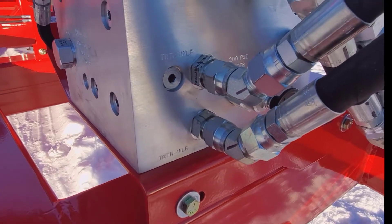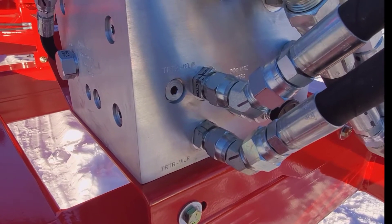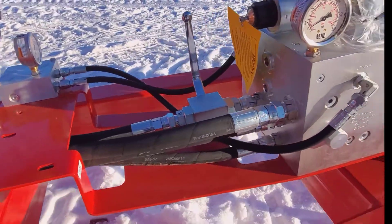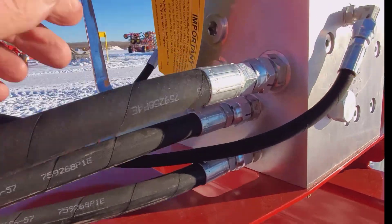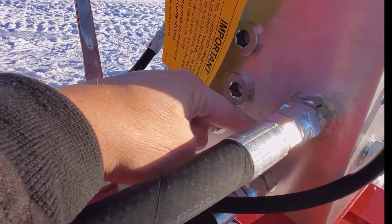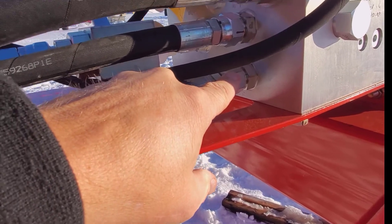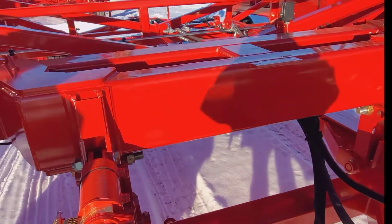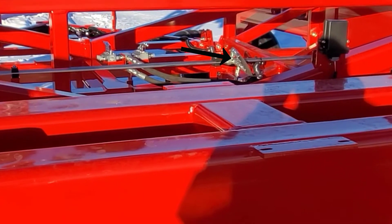When we go to wing it up, we simply reverse the flow from the tractor — pressure and return — to wing it up. But it has to be in the proper direction. The block is basically ported right through. We have our pressure and return hoses, two half inch hoses down at the bottom, and it sends the oil to the center of the drill and out to the steel lines.